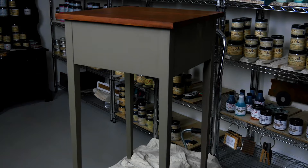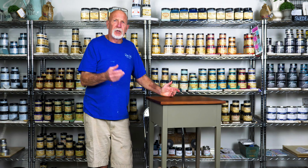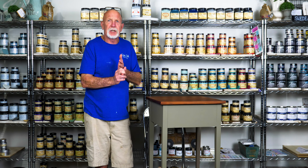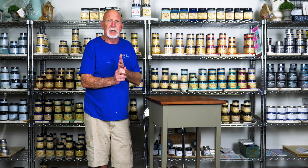Well folks, this is it — it's completed. Two coats of the Hampton Olive and the Silk. I waited two hours in between coats. Now I'm going to wait 21 to 30 days for it to fully cure. The best thing is it does have the built-in top coat, but for extra protection I'll come in with the Dixie Belle Extra Coat to give it that final protection.